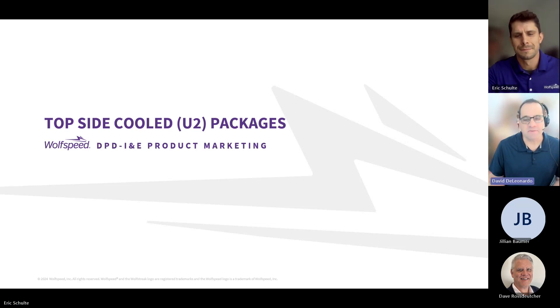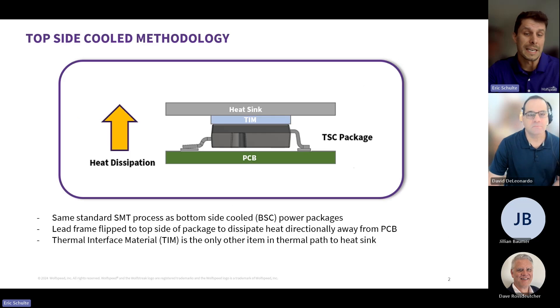I've seen a lot of interest from my customers in topside-cooled silicon carbide MOSFETs. Tell me, how does the thermal performance of your package compare to that of the same die in a D2 pack or some other surface mount package? It's a great question, Dave. Perhaps it'd be helpful if I start off with just answering what exactly is topside-cooled. There's a lot of discussion, a lot of excitement about this new packaging technology from customers today. Implementation is pretty straightforward — we're taking the heat path and actually flipping it up out through the device. So customers familiar with surface mount devices such as a TO263 7-lead will solder devices on the exact same way, but the cooling path is flipped so it goes vertically out, away from the PCB.